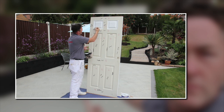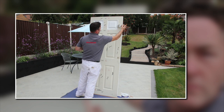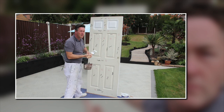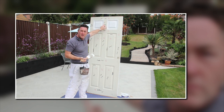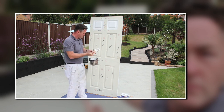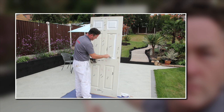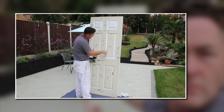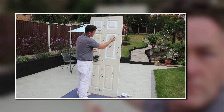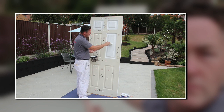It's a textured door — it's got the wood grain on it all the way around. I'll wipe my brush down and scrub off those fatty edges. Those will dry off, so when I come back to do that rail — the mullion, the top mullion — it will all be dry around it so we're all right with that. The marker pen — I'm hoping it will actually show through this water-based paint, it will bleed through. With water-based you don't have to play about with it; get it on and lay off.